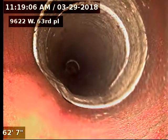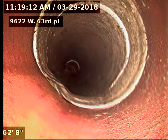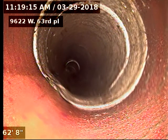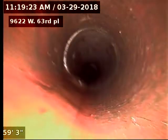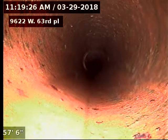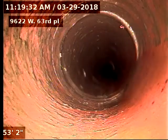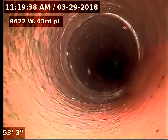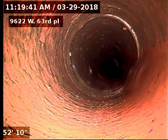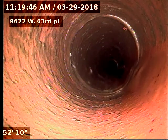You can see here at 62 foot we do have a crack in the line that is underneath the sidewalk, just into the curb. At 52 foot, that is in the yard — versus the concrete — the crack is pretty small.